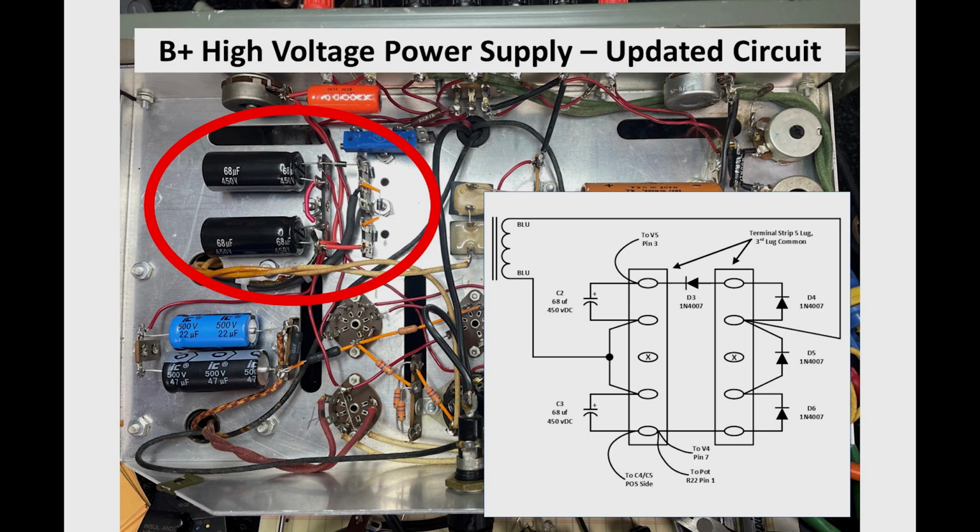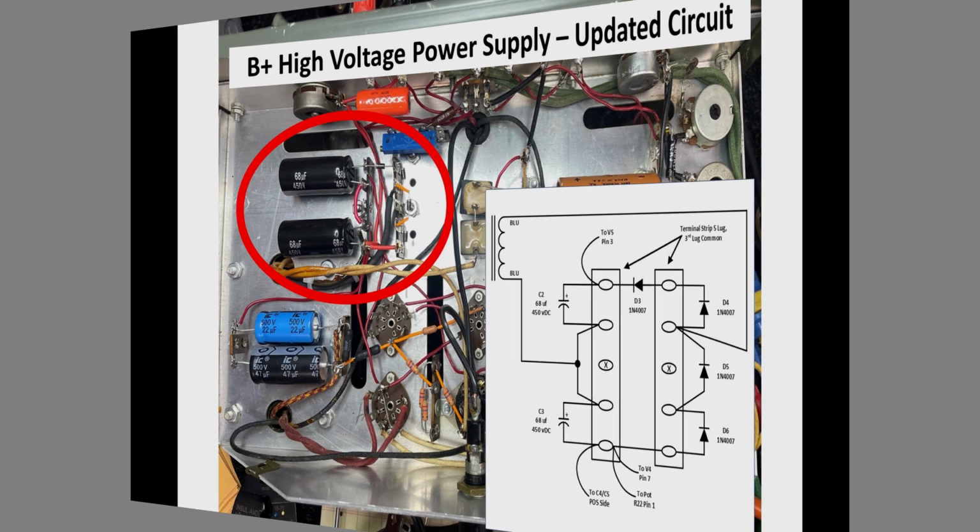The way I did this was I got rid of all of those white ceramic diodes and wired it up on 2 terminal boards. You can see how I wired the diodes. I wanted to make sure I had the polarities right and the wires landing in the right place. I drew it this way so that it looks exactly the way it does when it's installed, so I can glance at the banding on the diodes and make sure I had it right.